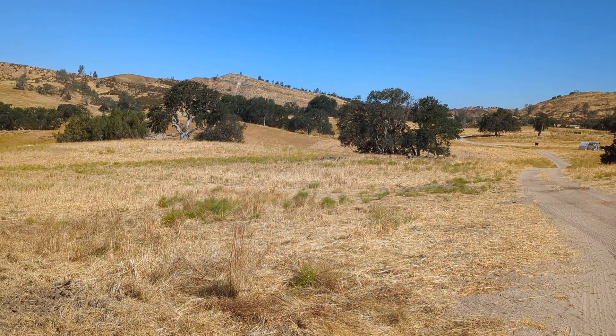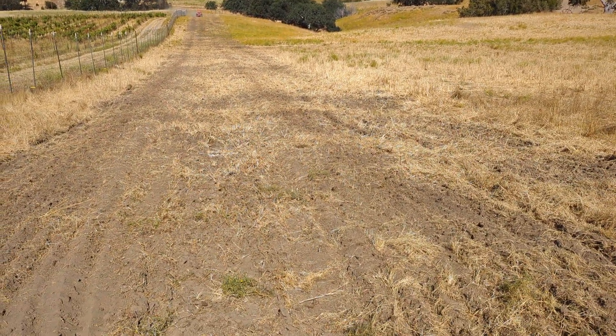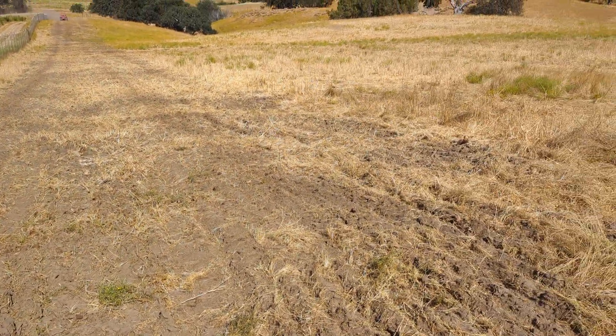I'm going to do a little bit of a hybrid of that since I'm trying to really break in this pasture that's mostly weeds and some no-till ryegrass I attempted to plant last year. It did okay, but not amazing. I want to give this pasture a jump start, so we're doing some really light two to three-inch shallow disking — knock down the squirrel holes, we've had quite the summer of squirrels — and also just break up some really hard dirt. We've had a couple heat waves and the ground is hard as a rock, so my no-till drill doesn't have enough weight to crack it open.